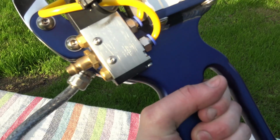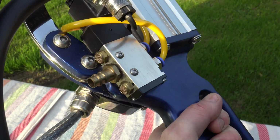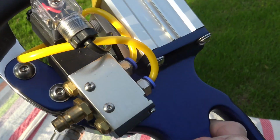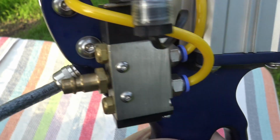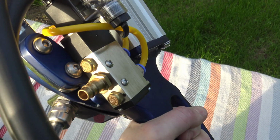Sorry, the pneumatic air goes onto this male valve here. There's 2 exhaust blow-offs here, noise dampeners. What do you call them? Mufflers. I'm sure there's a technical name for it, but I don't remember. And I think it's polyurethane pipes. I think I had nylon pipes at the start, and they were too rigid. That valve is directly bolted onto the actual plates.